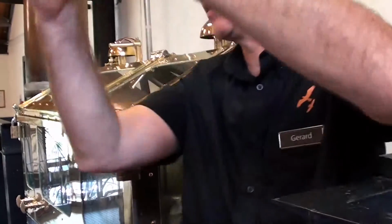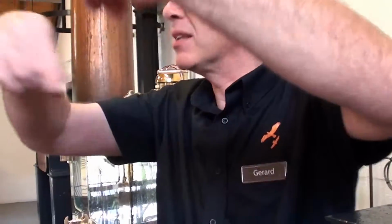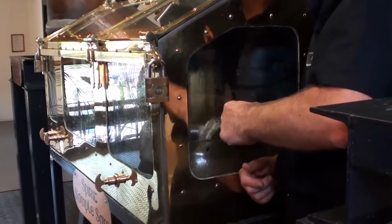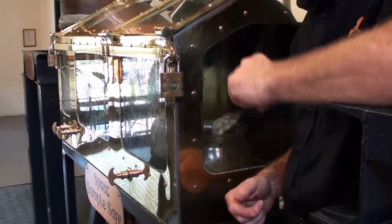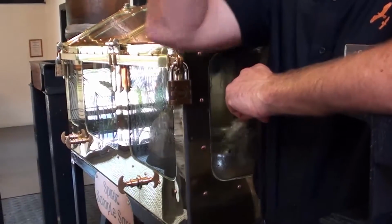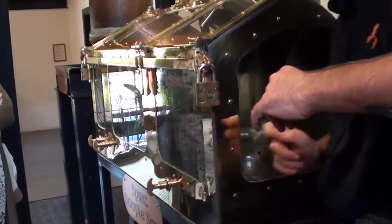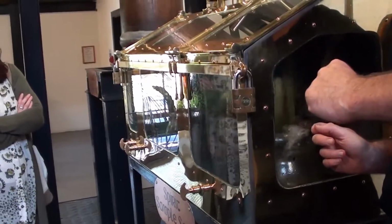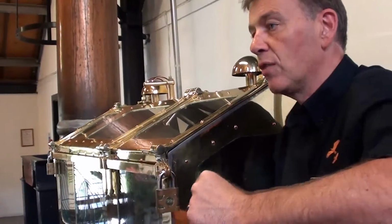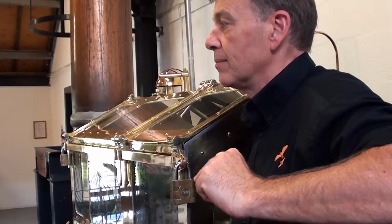But then, because we're collecting the alcohol from the beer, there's always less and less to collect. So the spirit is getting weaker and weaker all the time. After 5 hours, it's down to less than 1% alcohol. So we know now that we've got all the alcohol boiled out of the beer, which is the whole point. And when that's mixed together over that 5 hours, it averages about 23%. So not strong enough for whiskey yet, but it's a good start from an 8% cloudy beer.